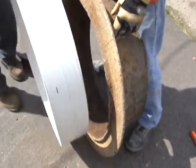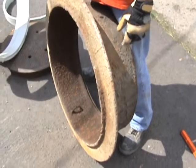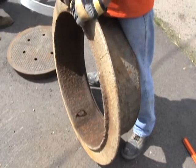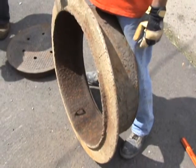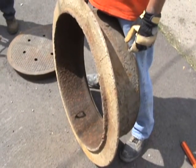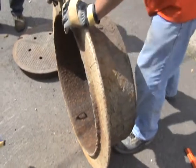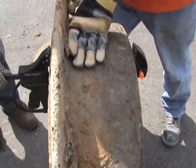Let's try a piece of 30 and see where it falls. This is a 30-inch liner and, as you can see, it is big enough to go outside of the flange. We want to get the measurement of the frame from top to bottom, and we don't want to include that flange because we're not going to be putting it right on top of the liner.